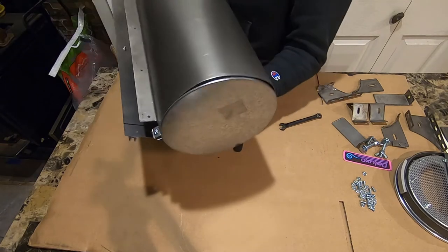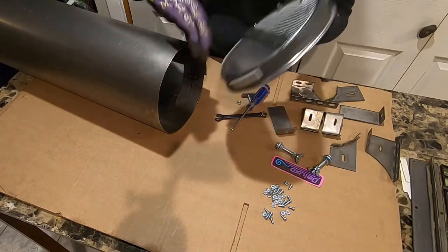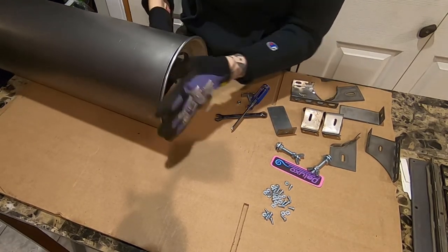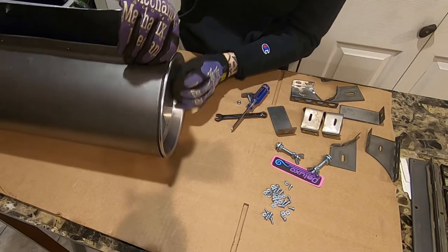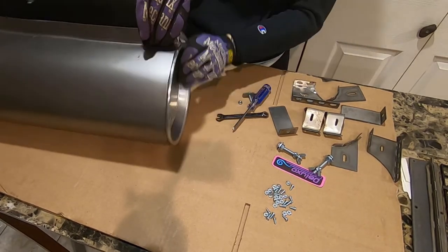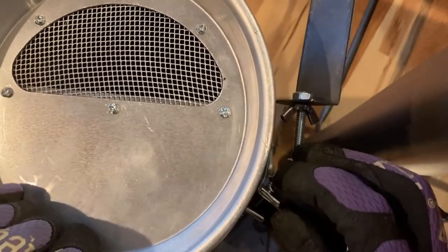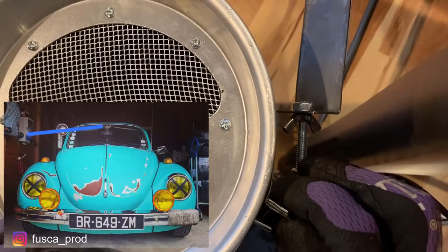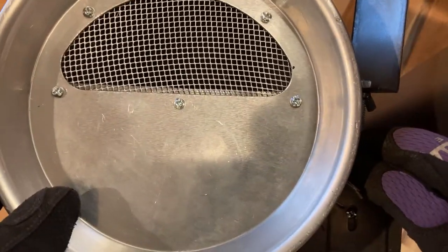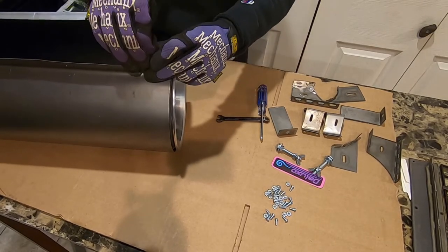Now after we do that, we can do the other side with the intake end cap and the foam tape. Now this intake end cap is only held in by the foam tape, so you can position it before we tighten it down. But once the cooler is built, all we need to do is loosen the cooler can body up and you can reposition this intake to be level with the ground, however the cooler ends up sitting on your vehicle. With the intake end cap in, we can go ahead and install the tension bolt and its squared washer for the intake end.